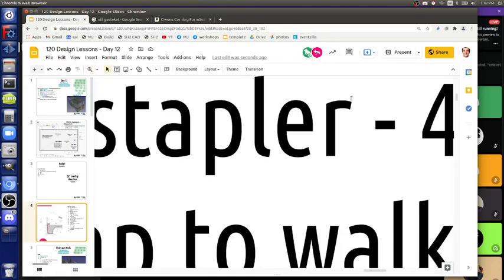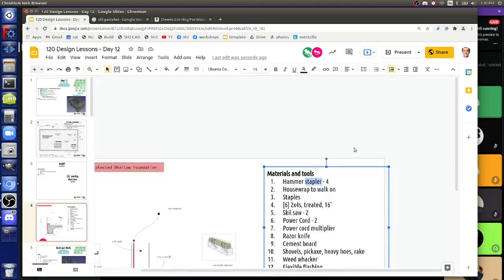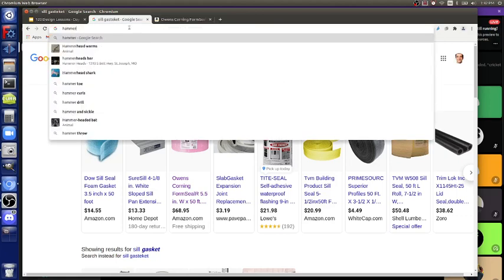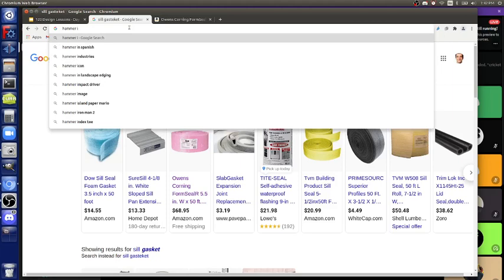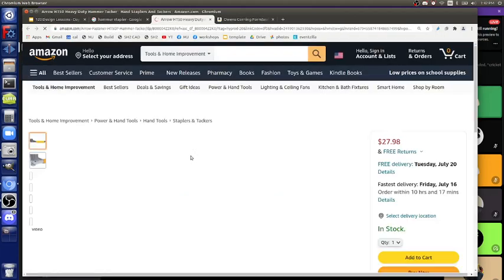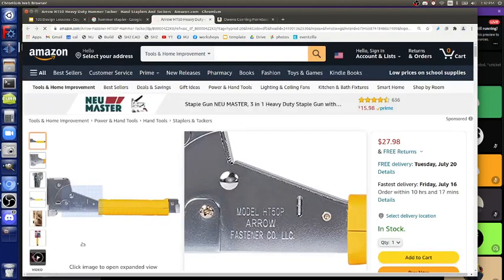What's a hammer stapler? We'll use these to attach the sill gasket. Have you ever seen one of these? You put staples inside of it, and then you whack whatever you've got to staple. The easiest way to attach the sill gasket, since the foundation is very hard and you don't want to screw into that, is to attach it to the 2x4s that we're putting on. So the first step, after we get the sill gasket out to the site, is to attach it with the hammer stapler, and then put the lumber down